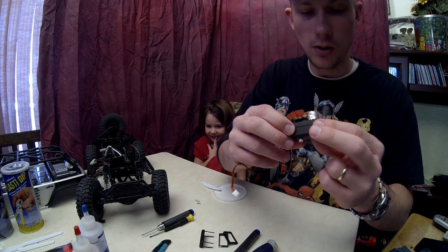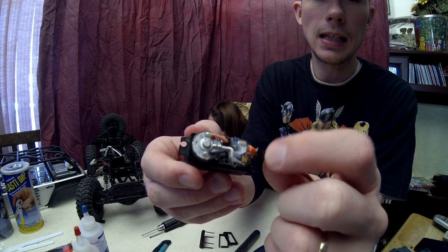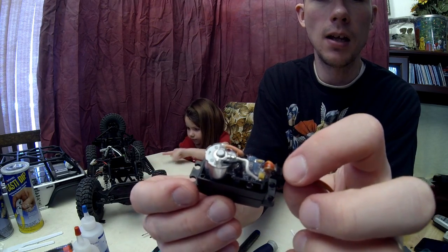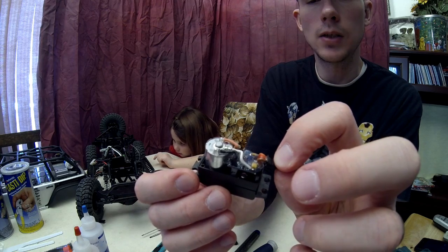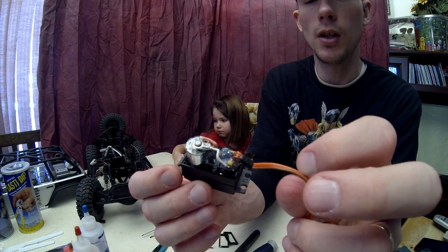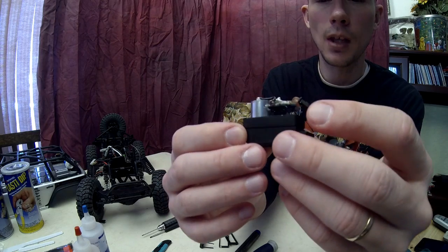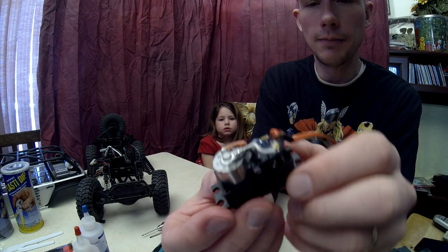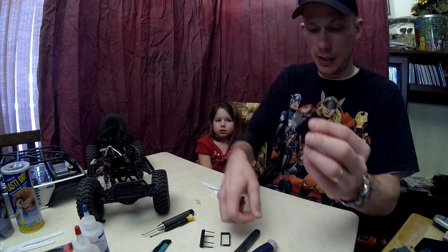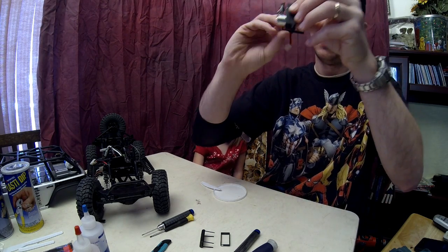Okay. So you can see some of it started to run just because it's liquid. But this gasket right here where the wires go in is your weak point, because I can't tell you how many times I've had plastic dip, whatever, fail here, because the water will somehow manage to work its way down one of these little groove channels and then work its way under the plastic dip and right through here inside, and you're done. So that's it. Pretty simple. Okay, let's get all of our tiny spacers put back on here real quick.